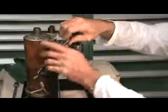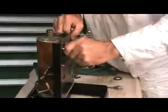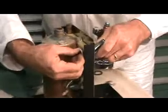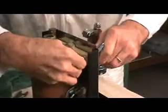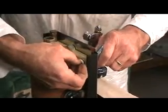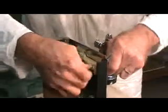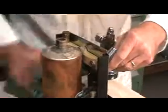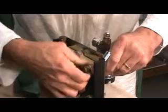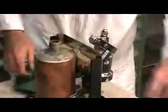So I put this on, my O-ring's in there. Now, this is a real good part. I got 1 minute to do this. This is like speed rebuilding. What I do in these times is I go ahead and use one of these Teflon guys. And I put it on there. And the Teflon seals the water, but it doesn't hold the faucet still. Got that started. And I put my copper on. And then I find my retaining cap. Where's the retaining cap? There it is. Okay. Now the Teflon seals the fitting, and the copper holds the thing in place.